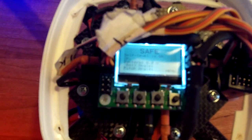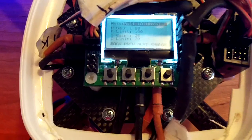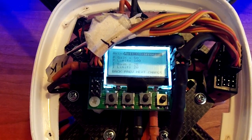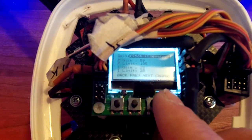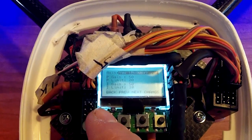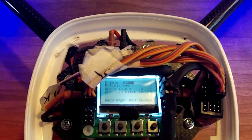Please note, this is a 1.5 firmware and I will run through the menu. The roll and pitch has a P gain of 50, a P limit of 100, I gain of 25, and I limit of 20. The yaw is 50, 20, 50, and 10. That is your basic setting. Your self-level setting is 60, 60, 0, 0.